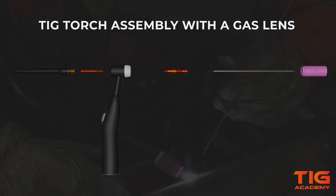The assembly of a torch with a gas lens is not much different from one with a standard collet body. You will only have to replace the collet body with the gas lens and the gas cup with a larger one — a gas lens cup. We are also placing an extra gas lens insulator on top of the standard insulator, which we already put on the torch body. The collet body is replaced with a gas lens, which is screwed into the front side of the torch. Tighten it before anything else. If you tighten it with the tungsten already inserted and the back cap screwed on, your tungsten may fall out and you can get conductivity problems. Next, slide the collet into the back of the gas lens and put the tungsten in from the front or the back as you like.